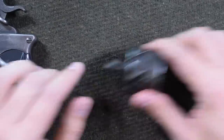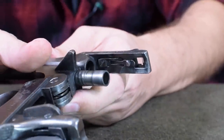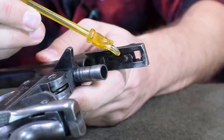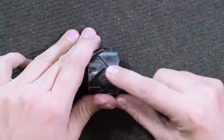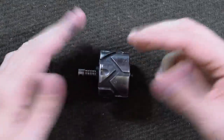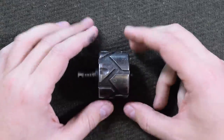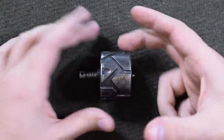Now, what prevents rotation is actually, and again, I'll have to try to get this where you guys can see it, is this front spud up in here. This guy, at the rear rather, sorry, not the front, the rear, he's locking into the opposite guide raceway on the cylinder. So let's explain how the cylinder works then. Obviously, a lot of you can see visually that this really is the description of the motion of the revolver, the rotational motion of the revolver, writ onto the outside of it.